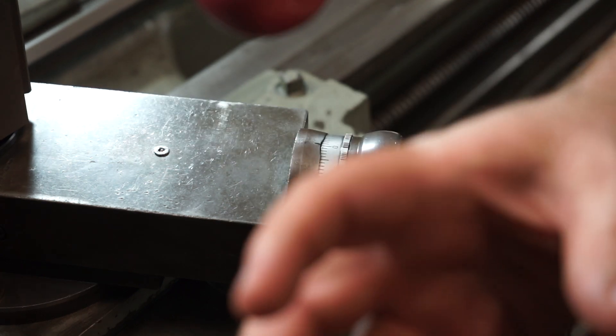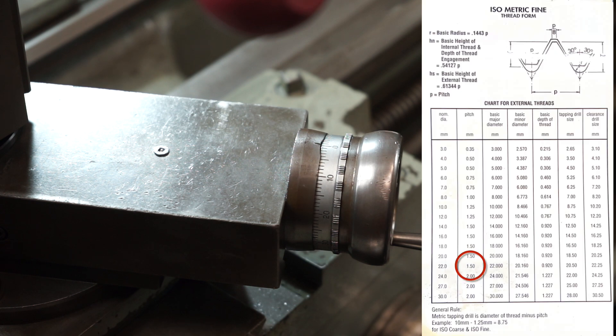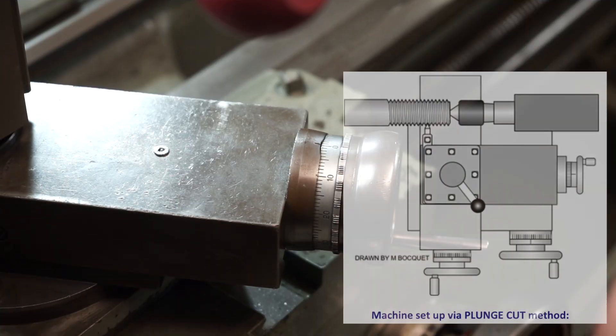Let's talk some quick math. When I look at my Kenwell's manual for a 22mm thread with 1.5mm pitch, the basic major diameter is 22mm and the basic depth of thread is 0.920mm. To calculate it yourself: take your pitch — 1.5mm — multiplied by 0.6134. When we were teaching apprentices we'd say memorize 0.61, but let's go further: 1.5 × 0.6134 = 0.920mm depth of thread. That concurs with what the book says. Now, that 0.920mm would apply if I were using the cross feed.